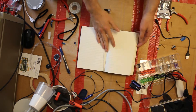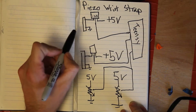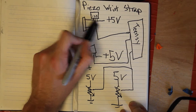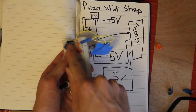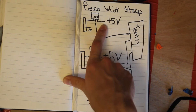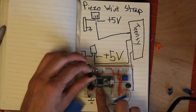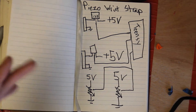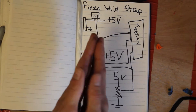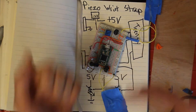These are all soldered up now and looking good. The circuit overall is really simple — the piezo discs are driven by the auto transformer. The auto transformer has three pins; the one with the gray tab is the control pin and we hook that directly to a tone pin on the Teensy, give it five volts, same on the other one. Then these two potentiometers — two little knobs — let us control what frequencies we're set at, because I don't really know what frequencies will work and I have no idea if this works. There's probably going to need to be some tuning. This gives us that control. Here's the schematic and here's the built circuit. Let's program it and then strap it to our wrists.